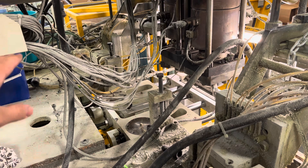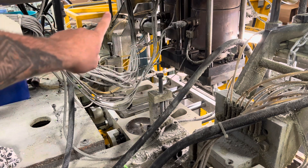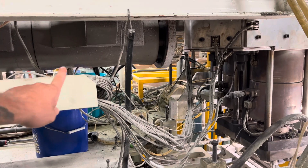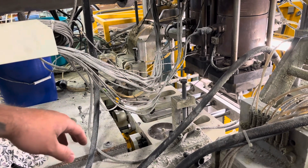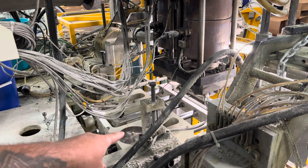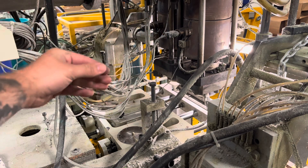This really is just a hodgepodge up here. We are on the top deck, right below the extruder. This is the head of the machine — this one happens to be a double head. This right here is the main 80 millimeter barrel, and this is all the wiring and everything that goes to the heater bands that allows the whole plasticizing process to take place. The knife that we just installed is directly below the head, so the parison will come out of the head and then the knife closes, cuts, and pinches all at the same time.